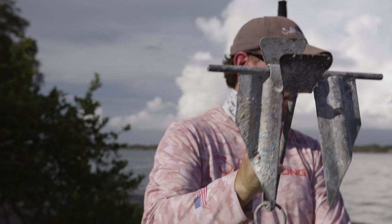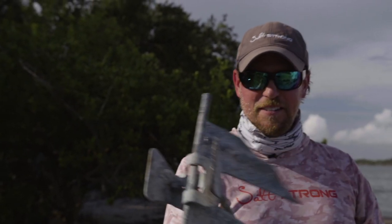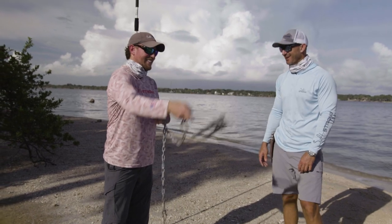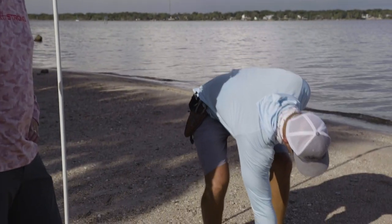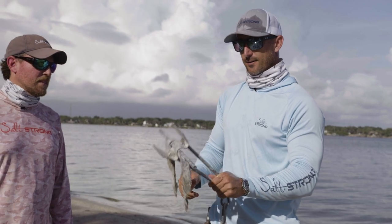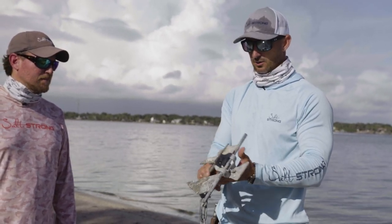And at the very bottom is this poorly made cheap generic fluke anchor — it feels cheap compared to the big ones. But everybody has it. This is the $39 anchor you'll find at any store. You see it at sandbars all the time — you know an anchor isn't good when the person has to physically push it into the sand, and then it pulls right back out when you retrieve it. We tried it with a lot of chain, no chain — we couldn't get it to work in any condition.